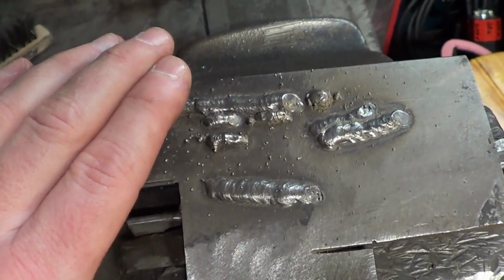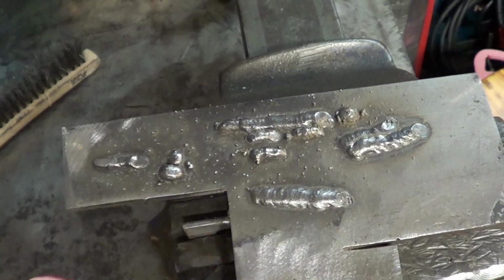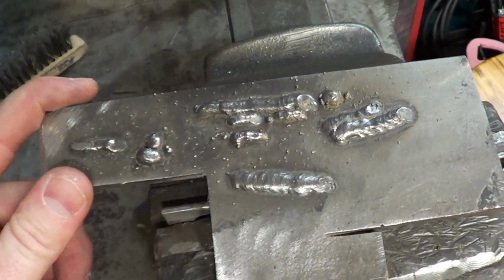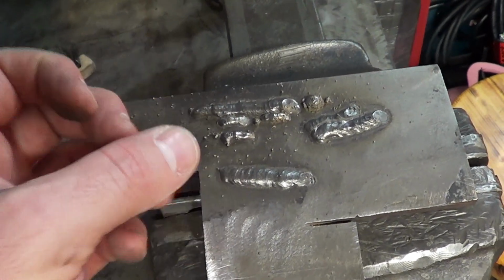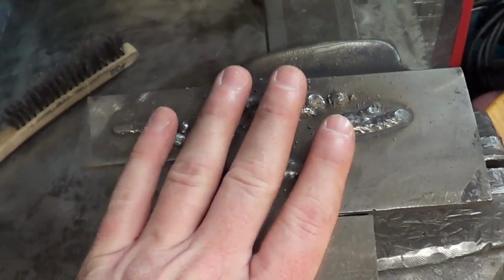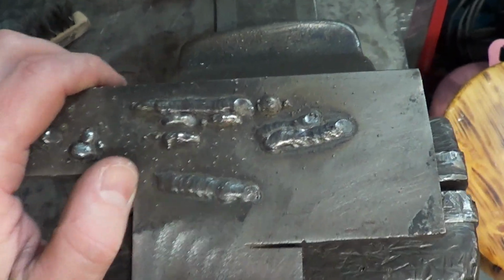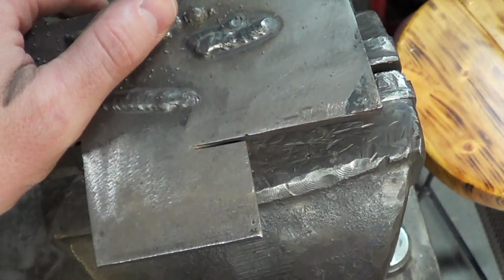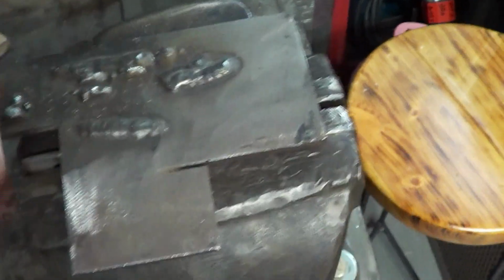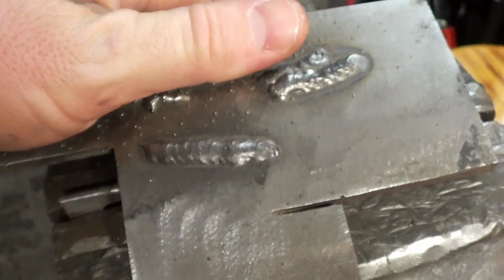I used to run the wire feed all the way up, or always above 6 or 7 towards 8, very commonly on the max voltage setting. So I just brought it to this and did that, and it was severing the wire. The arc was so strong, it was melting the wire before it really had a chance to get into the metal. It was almost like spray arc or something. And of course it was doing a bad job because it probably hasn't got the guts for that. So I brought the wire speed down to, I don't know, 3 or 4. And with just a little bit of weave action, it was getting very reasonable welds. They're flat. They lay in the metal nicely. Again, those are me working out the settings.